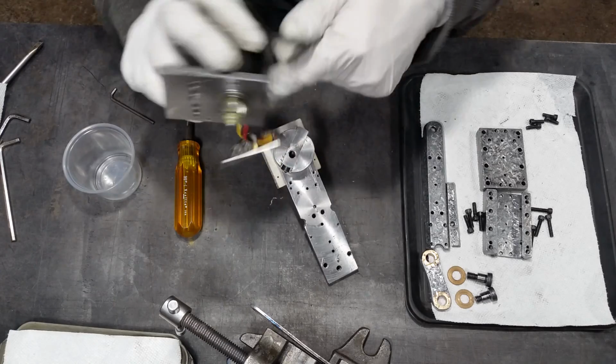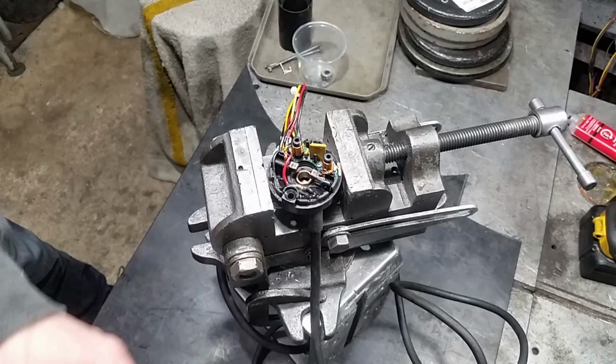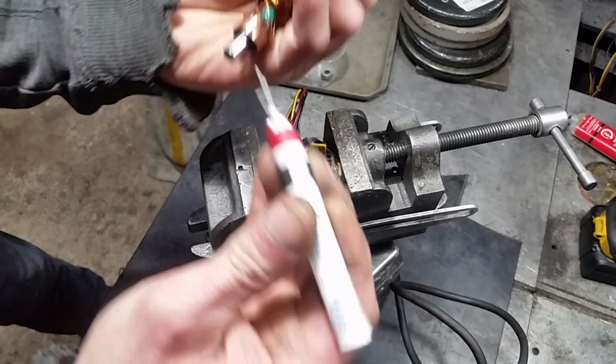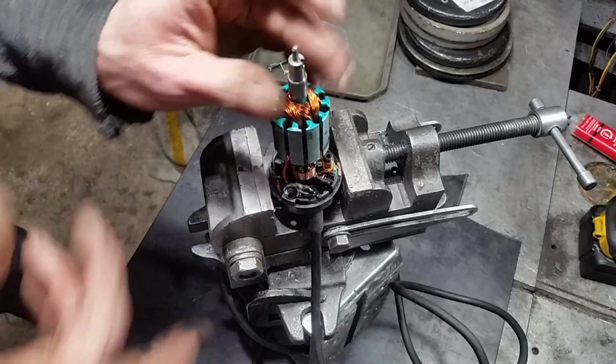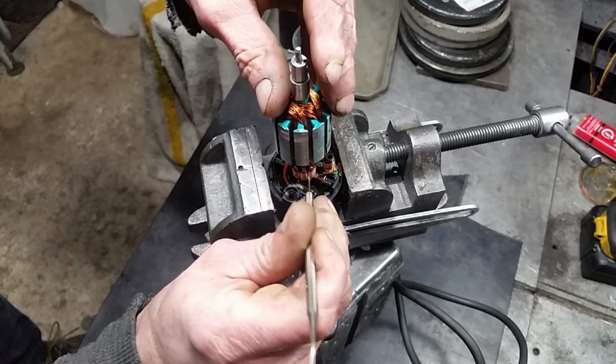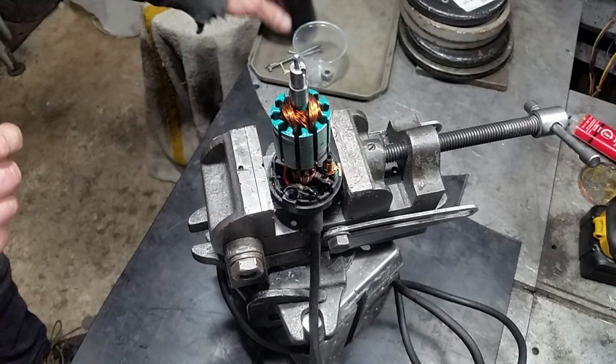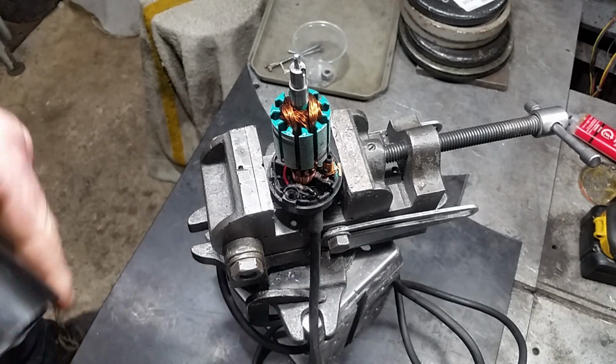It's just too much hassle. I have it. I took a video of it. I'm using some PTFE lubricant here on the shaft into the bronze bushing at the bottom. And then we just gotta press back the brushes here to get it to sit down onto the pads. Unfortunately, this can't be done after the housing is put over the top, which is tricky. That's what I'm about to do here.